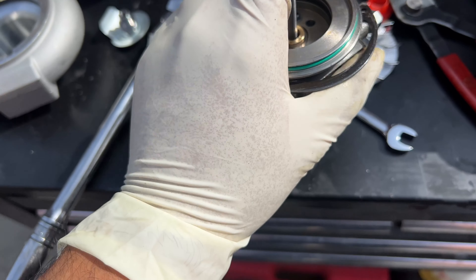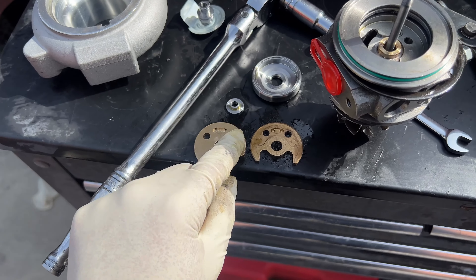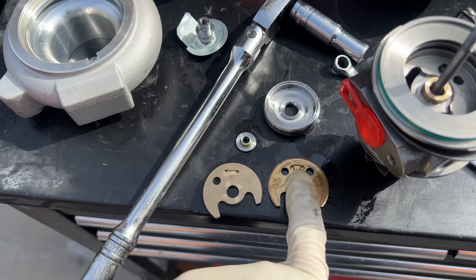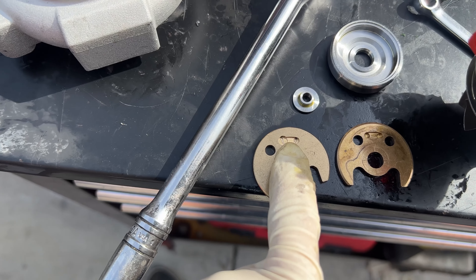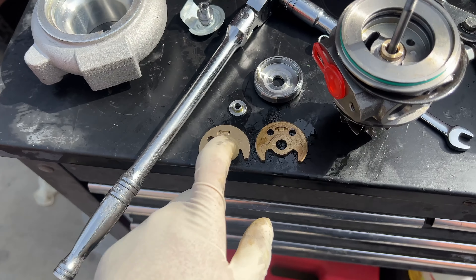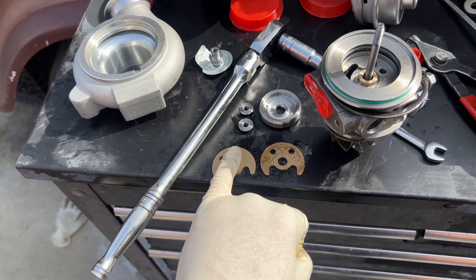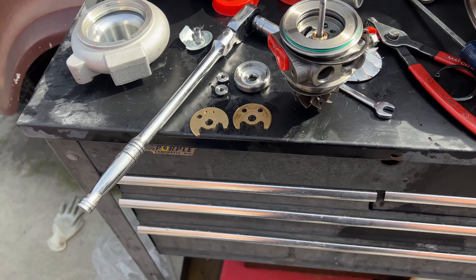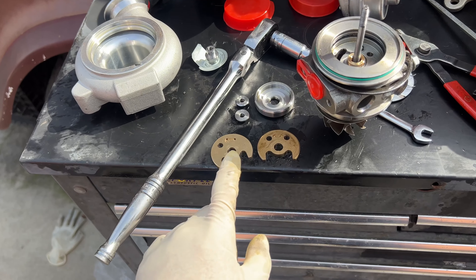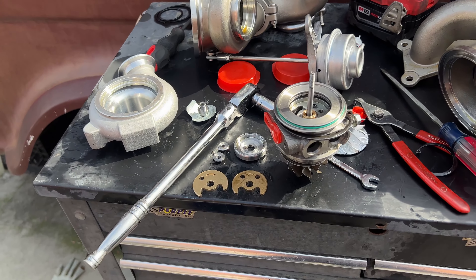It comes with a staggered piston ring — staggered instead of two flat rings. But I guess they still haven't perfected it, because this oil port area looks a bit different. These V4s are better internally, but not fully perfected. This oil port is still smaller than ideal. Other than that the bearings are good. The main issue is still these thrust bearings and washers right here.